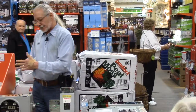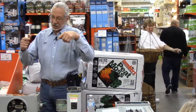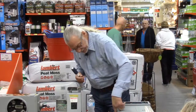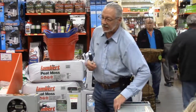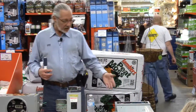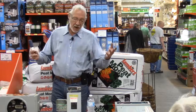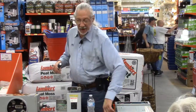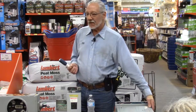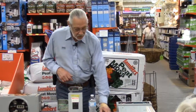Now you've made a map of your old panel where the pipes are coming in at the top. Let's say you have 5 pipes and they're all a little staggered. Most new boxes will have some sort of pattern on the sides, on the back, on the top. But the new boxes don't match the old boxes, so you're not going to find a pattern that fits the way the pipes are coming down. Probably you've got some things coming into the side. If it's flex cable, you don't worry about it. That can be put anywhere. But if it's piping, you probably want to map where those holes are.